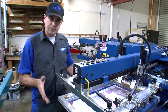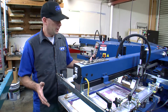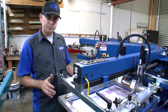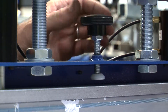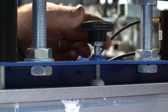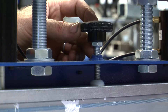At the end of a shift, some companies will shut their air compressors down, and therefore the press will lose pressure in its system. If you want to maintain the registration of your frames overnight, simply use one hand, run the manual clamp down until the white plastic foot touches the locking bar. At that point, give half a turn of pressure on the manual clamp.